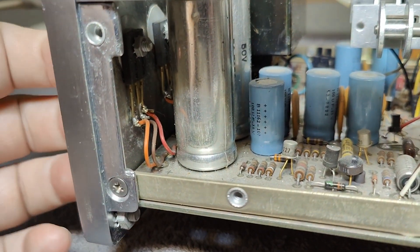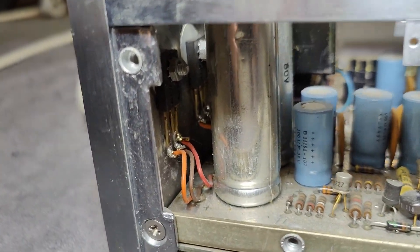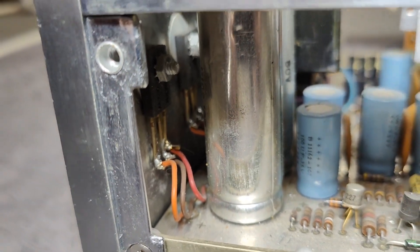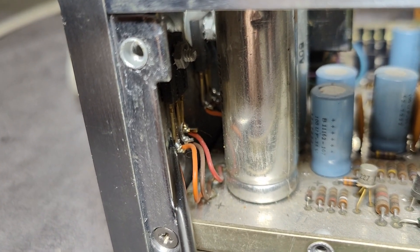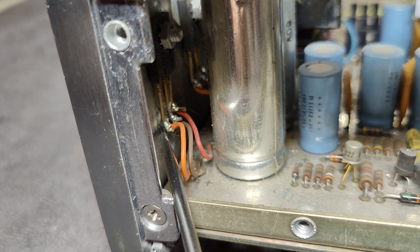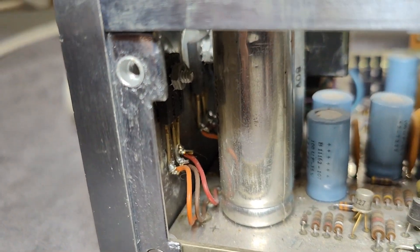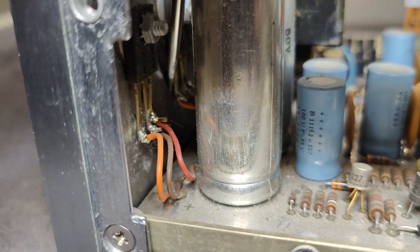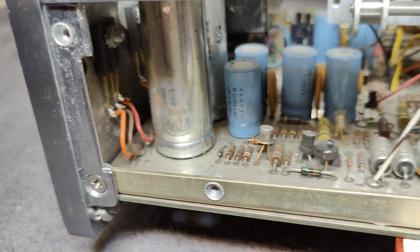Here on the back panel we have the power supply transistors. Somebody's been poking around with this trying to repair it, but they forgot the safety distance — those wires are more or less touching the rear wall. I will have to bend and fix some proper safe distances on both of those transistors. They are almost touching, so this is not good.